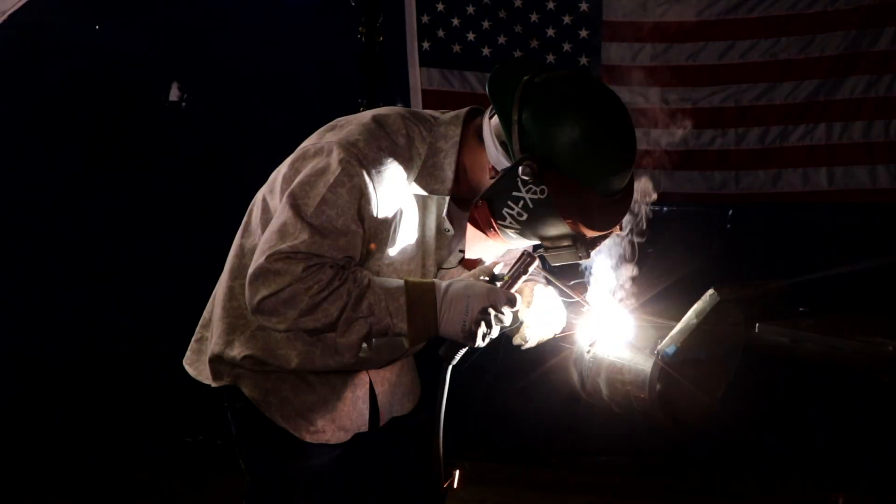Now, when you get something like this out in the field, you're not going to just grind out the indication and then go straight into welding. They're going to keep that pipe and they're going to shoot it again to make sure that you've gotten all the indications out and you're not just going to waste time filling it back up. So this is all demonstration, so we're just going to go ahead and fill it back up.